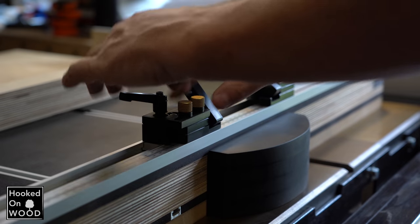This clamp comes as a single piece or as a set of two, and then it is very attractive from a price point of view. It is nicely finished and they are very small. Although small, they can still clamp pieces of 55 mm. They also have this white plastic ring that holds the spring, but this gets skewed if the bar is not straight to the ring, and then it becomes difficult to tighten. I think it is best suitable for holding down pieces to 36 mm — then it works best. Because of its size, it is very nice to work with on a drill press platform or a crosscut sled. It also comes delivered with a small dog hole, so you can also use it with dog holes, but the dog holes should be reachable from the underside of the table. Although small, you can give pretty much pressure — 60 kg is definitely possible.